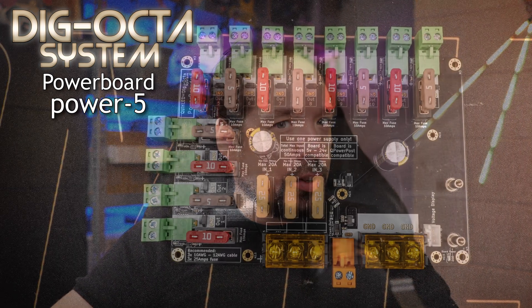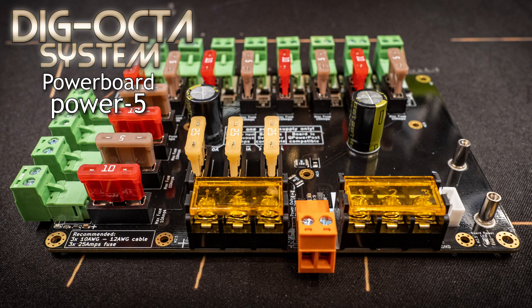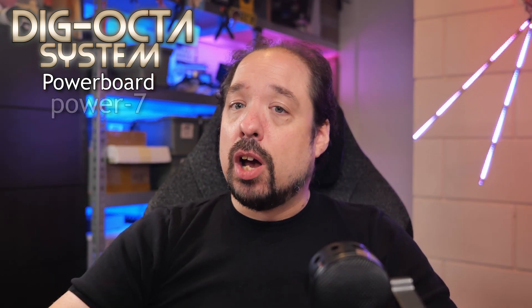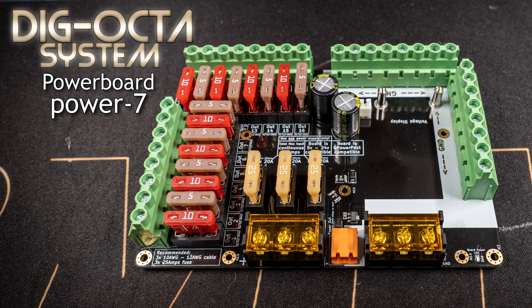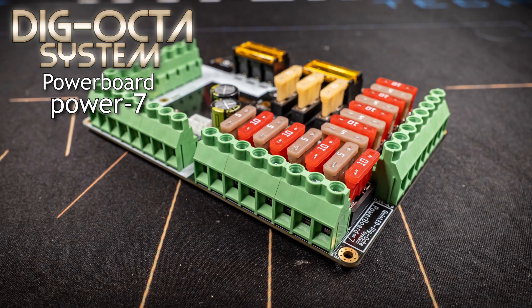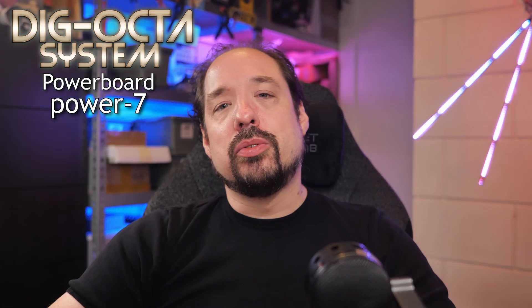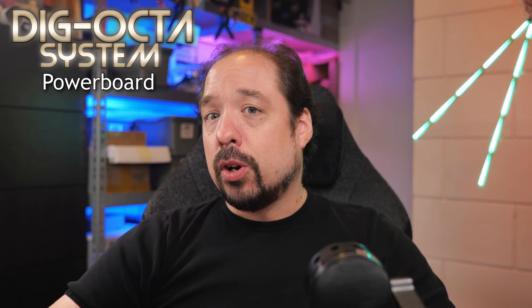For power, I'm introducing three boards. First up is the Power 5 — it has 12 times 5.08mm pluggable terminals for power output connectors divided over two sides of the board, and since these are pluggable connections that makes it easy to use even in a stacked configuration. Then there is the Power 7, which features a different design and layout philosophy: instead of having positive and negative next to each other like on the Power 5, they're now divided to sides of the board. This allowed for 16 times 7.62mm screw terminals which can take up to 12 gauge wire with wire ferrules.